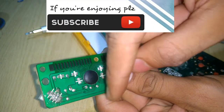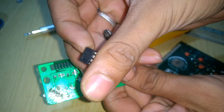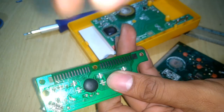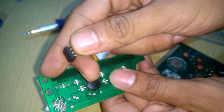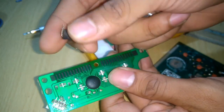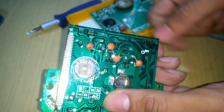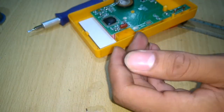The reason for using COBs instead of integrated circuits is basically the cost of production. COBs reduce the cost of production a lot because we don't need any kind of packaging, as in the case of regular integrated circuits. Also, they don't need to be soldered onto the PCB, so the soldering cost is also reduced, and in mass production they make a significant difference.